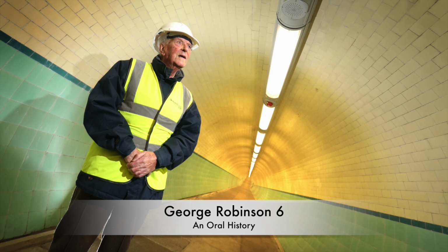And then what happened then was the pit boss used to go down, and I used to go with him, and he used to mark off where the holes had to be drilled for blasting, because everything then, once you hit the rock, the bedrock, you had to blast. So what he used to do was mark where he wanted the miners to drill, to put the dynamite in.